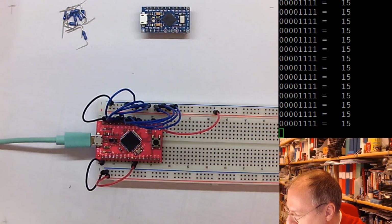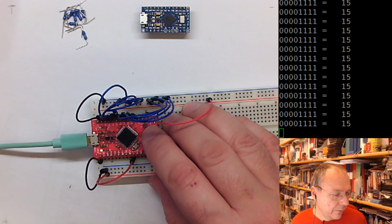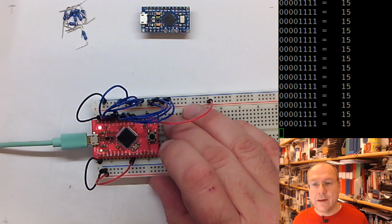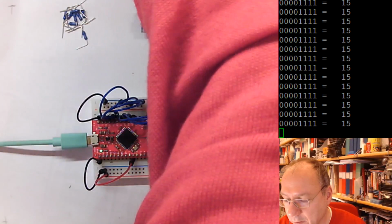Okay, before I remove this board out of the socket here, I'll disconnect the USB hub on which everything is sitting. Perhaps it was the hub or the USB cable somewhere. Ah, this sounds better. Yes, and now we're at COM9 for some weird reason. Okay, programming. I have no idea why it hung itself. I could imagine that it was somewhere in my chaotic USB cable wiring here under a lot of paper.